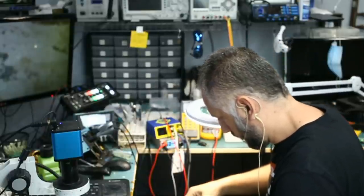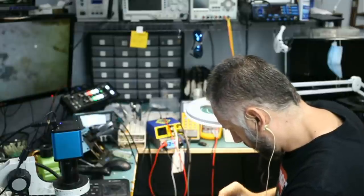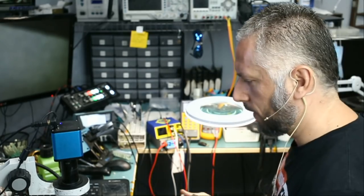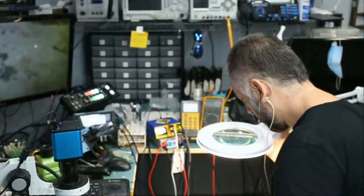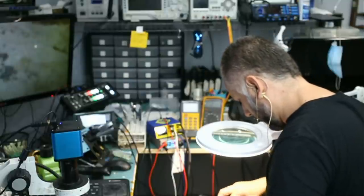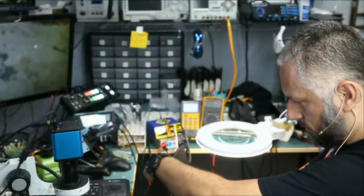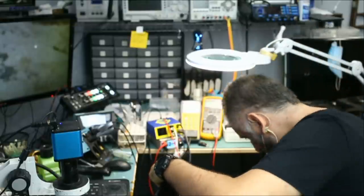Something is missing. Let me grab the battery, because some laptops need the battery to turn on. We may even need the fan connected for this computer to turn on. I can see the customer tampered with the battery connector and it's broken on the sides, but we should still be able to connect the battery.